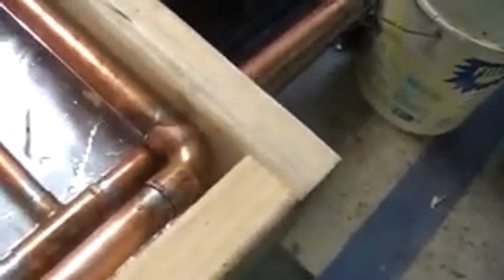So these were left off. This one, which is the feed, I used a SharkBite Tee. When I drilled my hole here, I could simply feed that through and make that last connection. So there's my cold, which will go in, and the hot — where it was a nice long distance — I was able to sweat it with an elbow.